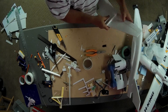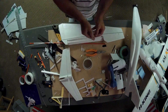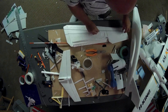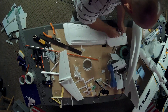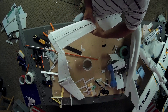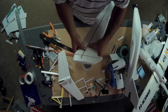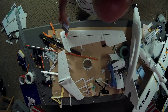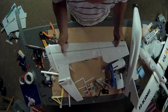Anywhere I thought I needed some extra strength on the leading edges, I added some packing tape. For the wing spar, I lined up some driveway markers from Home Depot but figured those would be too large and heavy, so I ultimately decided to go with some thin carbon fiber. I cut a slit across the wing and insert the carbon fiber vertically — it's a thin wide strip. This gives rigidity against wing flex, which is what you're really concerned with. I push it right in, then add a thin layer of Gorilla Glue so the foam seals back up, and a layer of packing tape over top to hold the glue and spar in place.